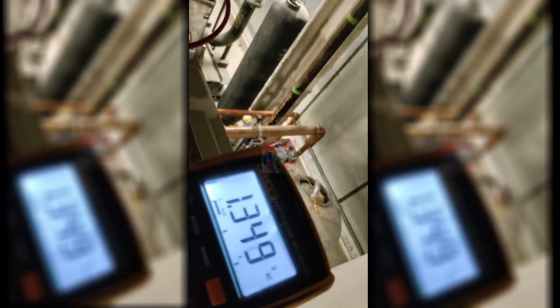Now it's on my neutral — you see it's on my neutral — and my other one is on the phase. So let's see what you see here: I'm getting 1.34 volts. So I'm not getting 277 to the actual neutral.